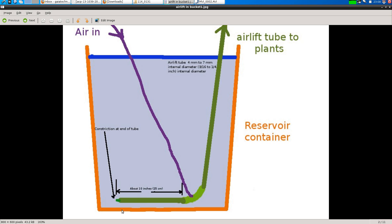There'll be an ideal size for this tube depending on how high you go, and an ideal size for the hole. There's also a thing called diodicity of the entrance hole — the entrance can be shaped in a certain way which makes water come through more easily in one direction than the other. If water goes in easier one way than going out, it's almost like a valve with no moving parts.